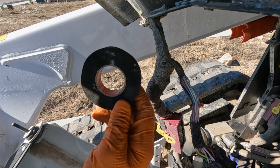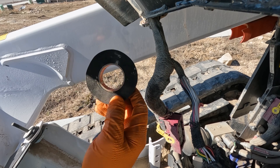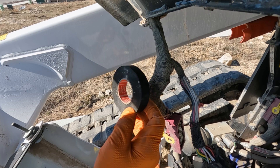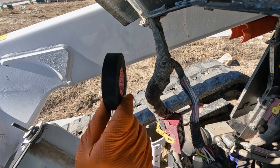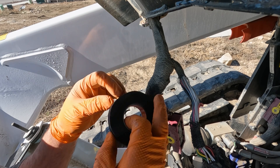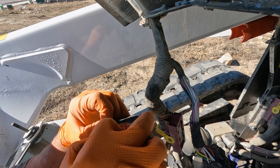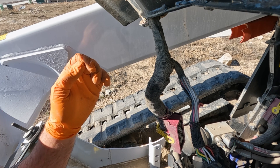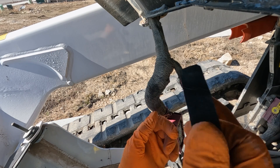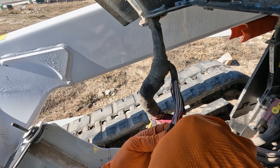So now to fix this harness, what we're going to use is Tessa tape — this is harness tape. You don't want to use electrical tape on these systems. Electrical tape just doesn't last with the heat and the weather and all that. It just gets real sticky and it melts off. If you want to do a proper repair on this equipment, throw away your electrical tape and get some harness tape. I can't think of a situation where we need any electrical tape on these machines, period. If you do the repair properly with those non-insulated crimps and all that, there's no need for electrical tape. Look in the description of this video and you'll see where to get this harness tape.